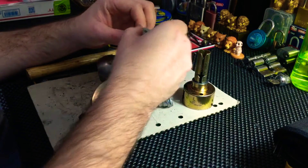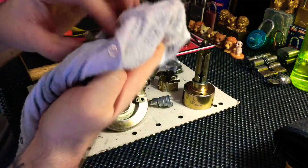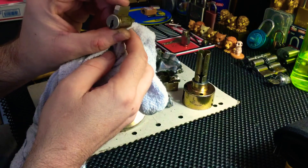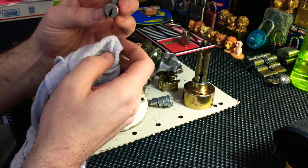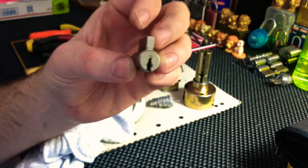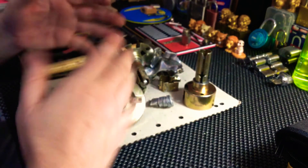As you can see I've taken it apart like a bloody tuna can. He did say just chop off the knob and you'll get straight into your cylinder, but me being curious and wanting to know how things work, I thought I would take it all apart manually. It's got a Schlage-style backing on it, and apparently it's got sliders in it and a pin tumbler mechanism as well, plus a bit of a paracentric keyway.